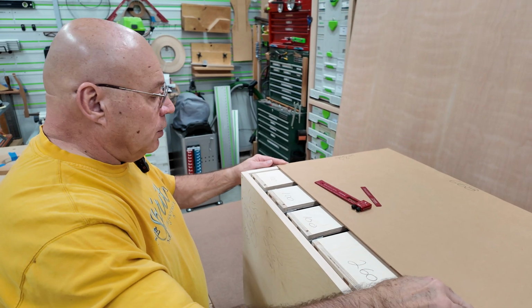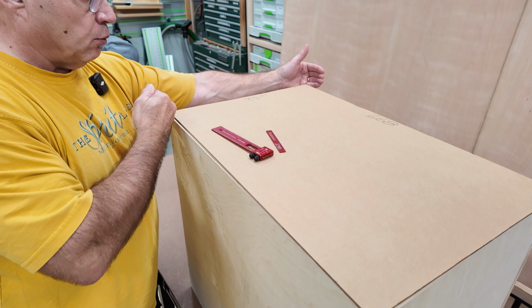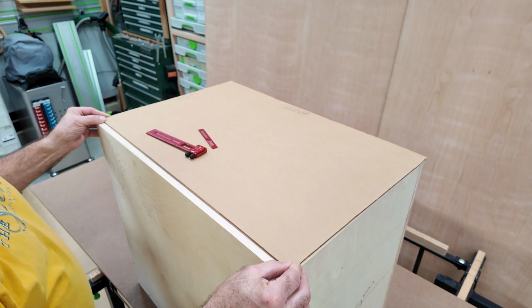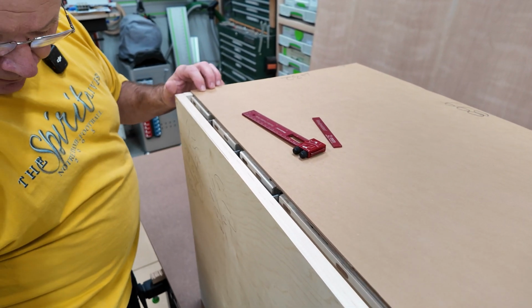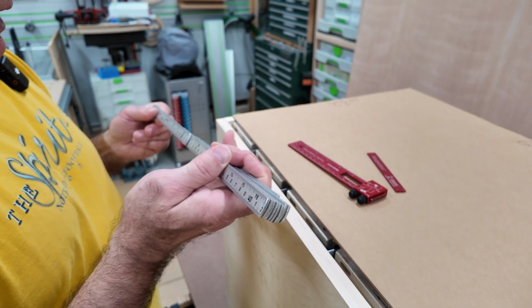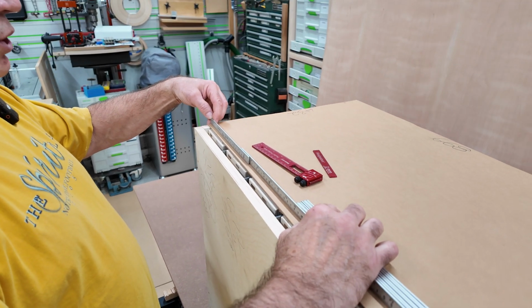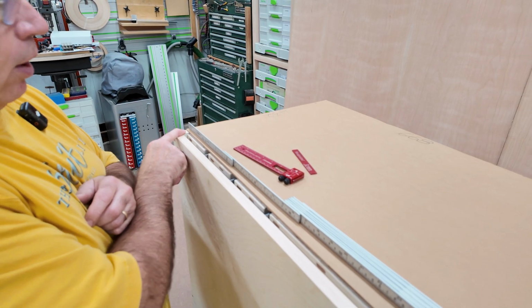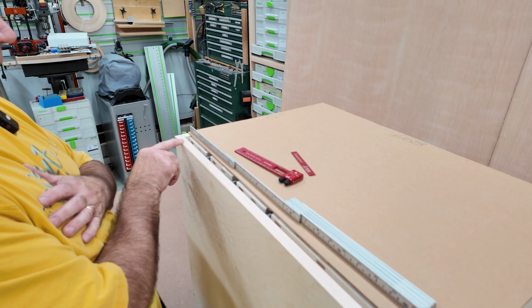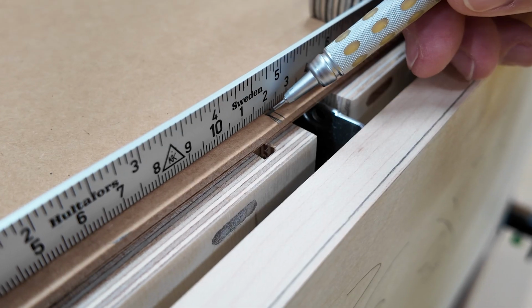So what I want to do is I want to take this, remember this 432 this way and 668 that way with that 2 millimeter reveal. But I'm going to bump it this way so we can look at the spacing. I'm going to come over here and wow, this looks good so far, because now I'll fully overlay up top. That's what I'm concerned about. And I'll just do this. I'm going to pick a number and I'll go 120.